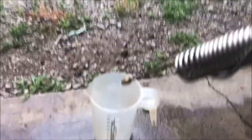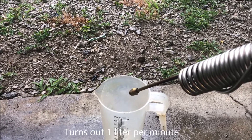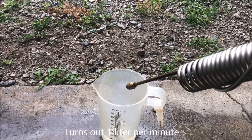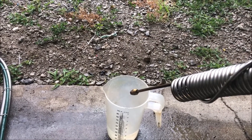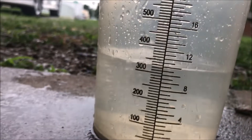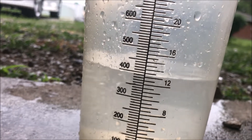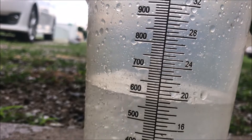A lot of people have been asking me what's the flow rate of this thing. It's not going to be quite the same as this right here because the system is no longer at pressure - we would literally have to condense the steam to observe the actual output. But it's looking like about 30 to 60 liters an hour.